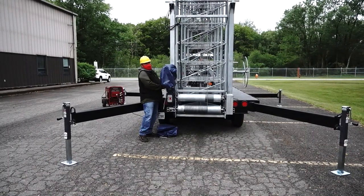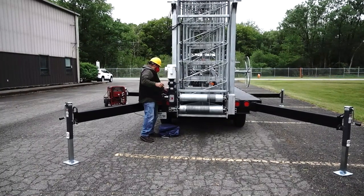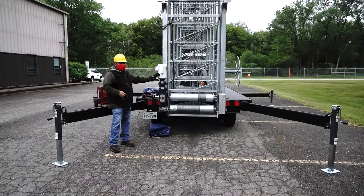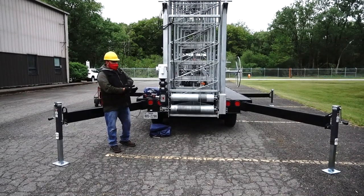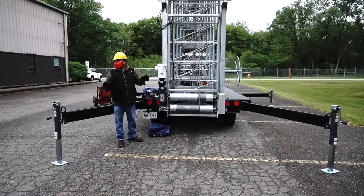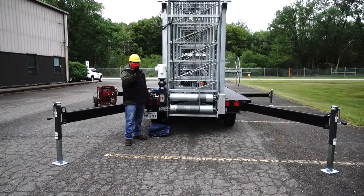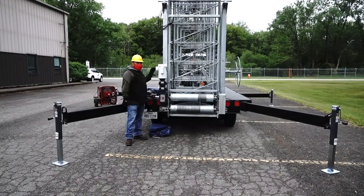We have the covers for the weather, especially when you leave the tower for a long time inside, to protect it from the weather, okay? We have the videos where we tested the motors under the water, and they run perfect. But that's not the problem. The problem is when you leave the tower for a long time inside. I believe you're familiar with the motors. Inside, when you have a little water, you have corrosion. Just a little bit, but with that little bit, your motor locks. So you need to open it, clean it, and boom. That's why we put the covers, to prevent that.